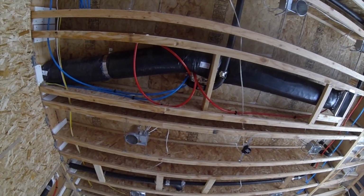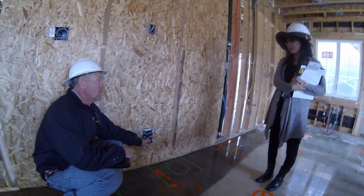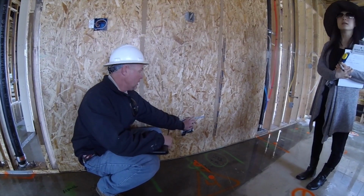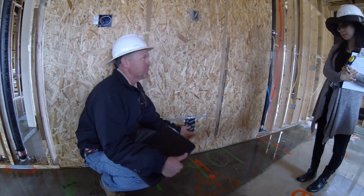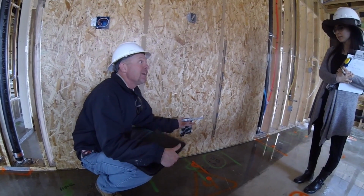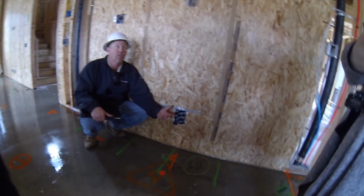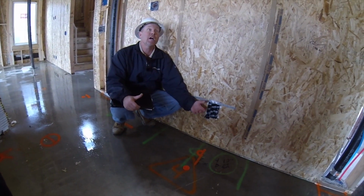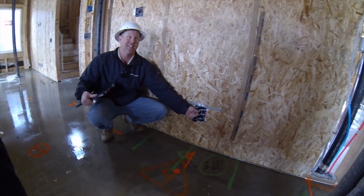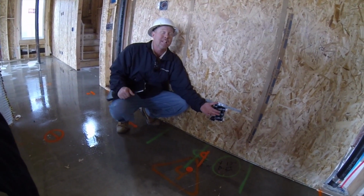So anyways, this right here is where your refrigerator will hook up to the water. These little hoses that come up through these refrigerators only have a life expectancy of a couple of years, and after a while they wear out and you get a leak, and then you have to replace the hose. In an emergency, who's got time to pull out a big refrigerator to get to this shutoff back here? You need to get the water off fast before it does any damage.